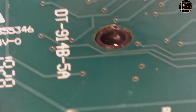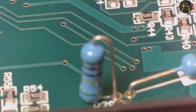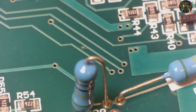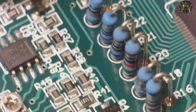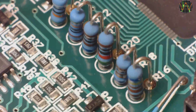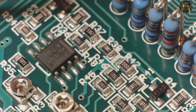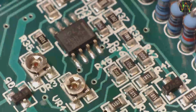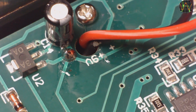From this protection circuit, the track carrying the input voltage crosses the PCB, ending in 2 5 megohm precision resistors in series, one standing and one lying really long across the board. The divider network for the different ranges is made of discrete resistors, which is okay for this class of meter. Next we have lots of SMD resistors and two trim pots around the dual precision op amp, and a voltage regulator for the incoming 9-volt battery.